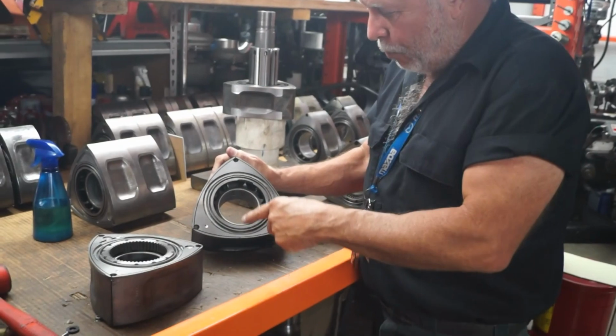So as your practice develops, a lot of what I do, before I do any kind of operation, is correct by adding clay, like you saw in that part, opposite to where it needs it, to see if the information that I have input into the balancer is good enough for repeatability. If it repeats the same results over and over, then you're confident that whatever you do, once you remove that part, it's going to take out that amount. But you have to double and triple check yourself, because if you trust your first spin without knowing that the setup is correct, let's say it's heavy here, and you remove weight here, you just added more work to balancing this engine, because you shifted the weight to where it's already heavy. You see what I'm saying?